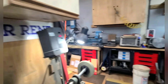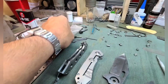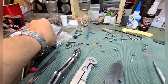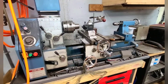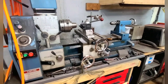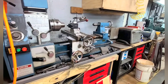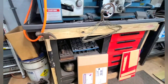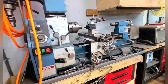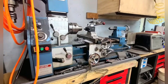I wanted to ask you about these pivots. You said that you used to buy the pivots, but nowadays I'm making them myself. You've got pivot collars, pivots — all titanium or stainless or whatever you need — and you're making them yourself right here on the lathe. That is a lot of work. Yeah, it takes a lot of time and a lot of precision. And how many do you ruin? Once I got the rhythm going and the cutters in position and everything, maybe I ruin one or two in the process. I'll make them in a batch — once I've got everything set up, it's really easy, just repeatable. Put a piece of stock, cut it, repeat, cut the threads. Just takes time after that.